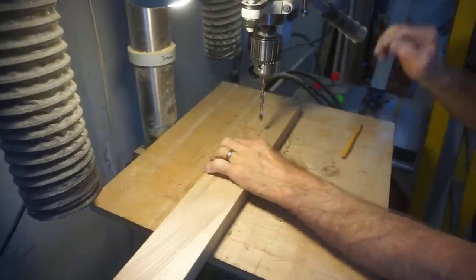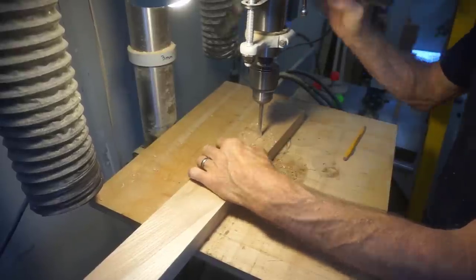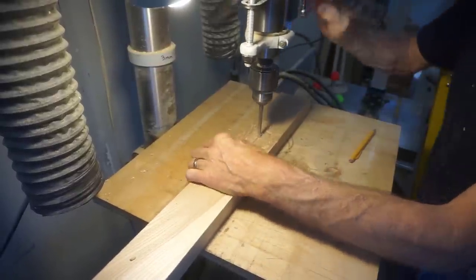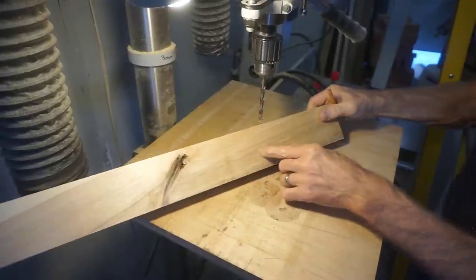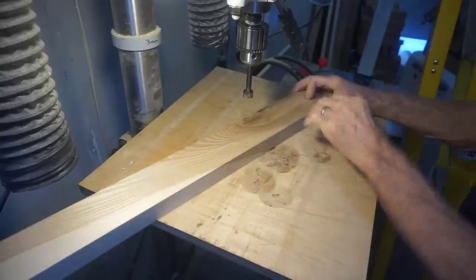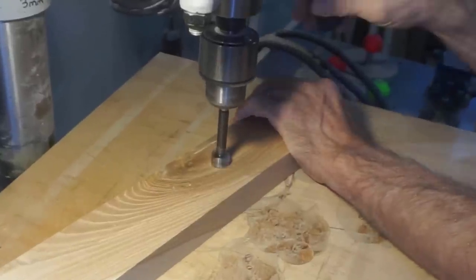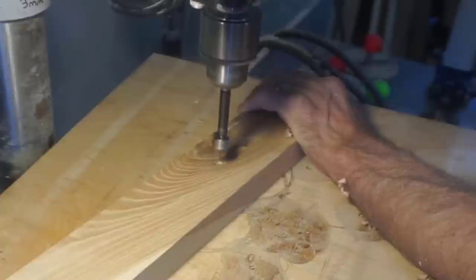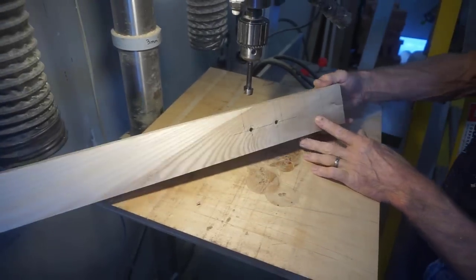I milled up a couple of ash 2x4s 30 inches long and, using dimensions from my ceiling location, drilled four holes five-sixteenths inch diameter with a brad point bit in one end of each piece to align with the tapped holes in the steel tube. I stopped short of drilling all the way through so that the tip of the brad point bit left the centering point for the next step. Using the centering hole as a guide, I drilled a three quarter inch by three eighths inch deep counterbore on the opposite face of the ash boards to recess the heads of the panhead machine screws with flat washers.